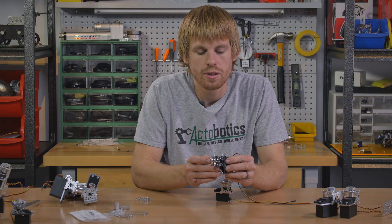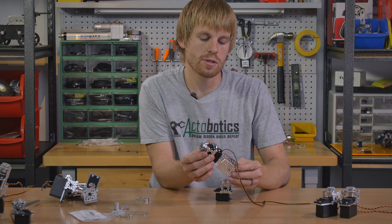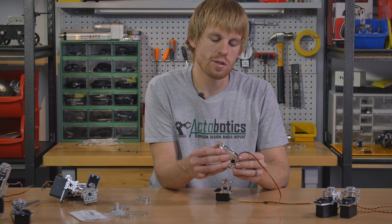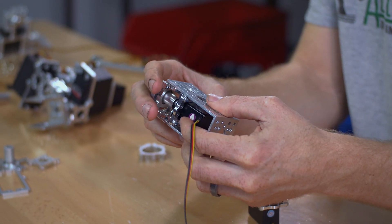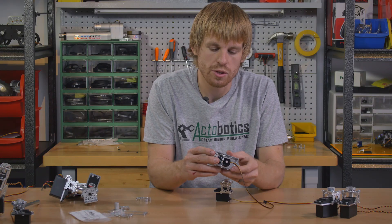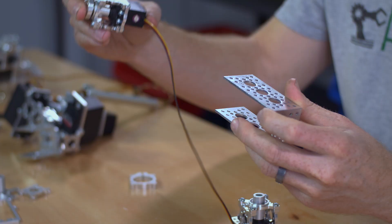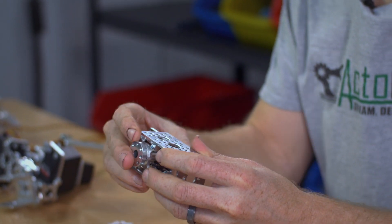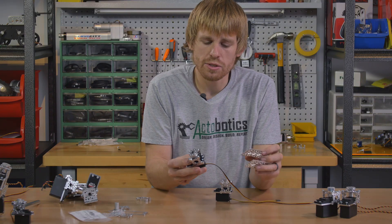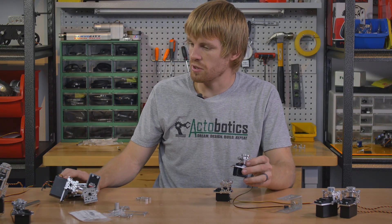The other nice thing about it is going to be mounting — you've got tons of mounting positions. This is 1.32 inches in overall width on the standard size. So you could just slide it right down in a piece of channel. You can use the 770 pattern on the side and run some screws in and bolt it in quickly. And you can rotate it in any position you want inside of the channel — it's going to fit about any way. There are tons of different mounting options available which we're going to get into in some of the assemblies.